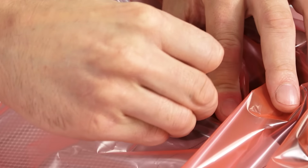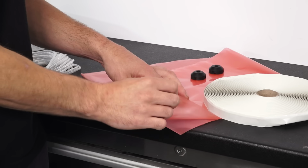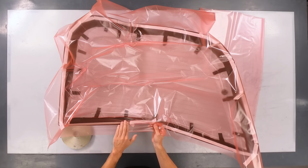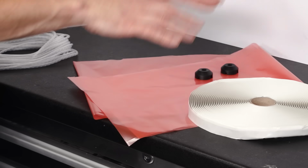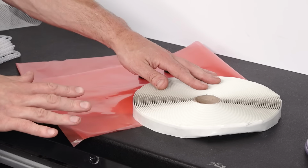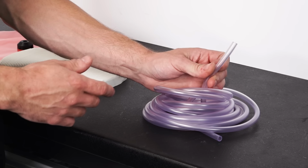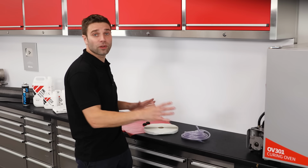And the last layer in the stack is the vacuum bagging film. For most infusions, a 50 micron nylon bagging film like the VB160 is going to be an appropriate choice. And this is then sealed down to the mould using some ST150 sealant tape. Finally, on the consumables, we have the disposable PVC resin and feed vacuum hose. Okay, so that covers all of the consumables.